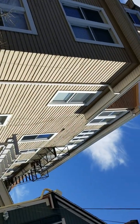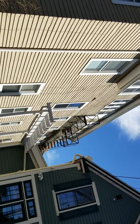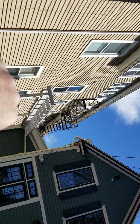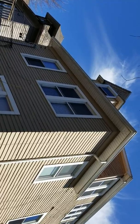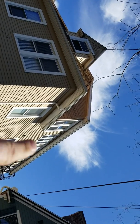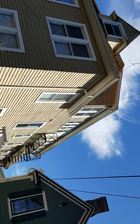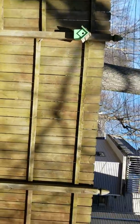We've got probably about 32 to 35 feet to the upper gutter here, not a lot of room between the houses. We've got an apron gutter that comes around with a return, the long gutter on the side of the fire escape, and another gutter underneath the fire escape. The roof is about a 12/12 pitch, so getting off these lower roofs would be impossible. The upper one is about a 9/12 pitch, so we're not going to walk that either — everything's going to have to be done by scaffold. There's no real way to get a lift back here at all.